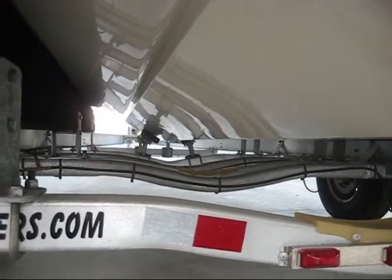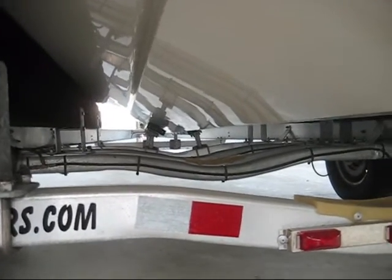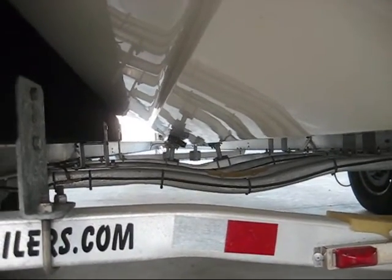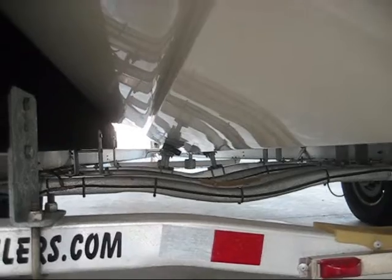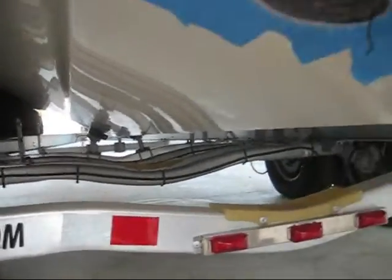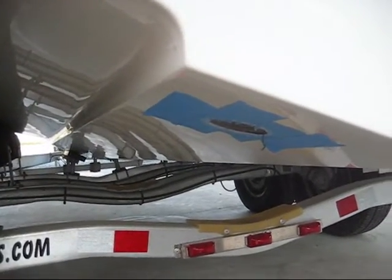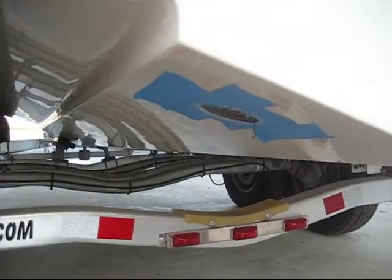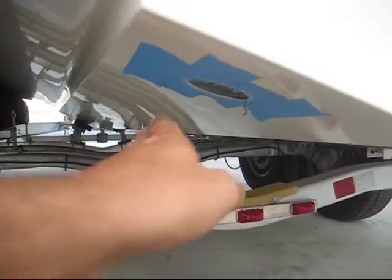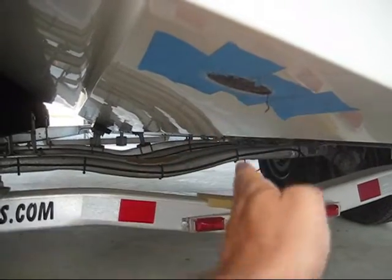You want to pick a location on the bottom of your boat that has no obstructions in front of where you plan on mounting the transducer. Any obstruction will cause turbulence in the water and that's going to affect the signal, making the transducer not work well at higher speeds. The spot we've chosen has absolutely nothing in front of the boat, and it's mounted where the dead rise is about 20 degrees — so we've chosen the 20 degree transducer so that the angle shoots straight down. Since it's a 20 degree transducer, all the guts of the transducer are angled so it shoots straight down.